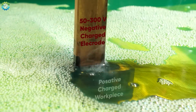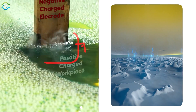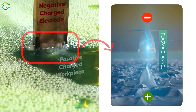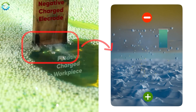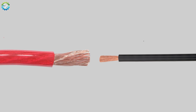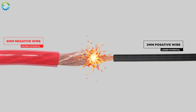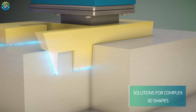When 50 to 300 high voltage of negative and positive charge makes contact, 12,000 degrees Celsius of hot electrical spark is generated between the electrode and the workpiece material. As a result, the hot electrical spark erodes the workpiece, causing it to melt and vaporize. This is similar to a short circuit between negative and positive electrical charge that creates a spark and breaks down material due to high potential difference in conductive materials, creating the desired cuts and shapes out of raw materials.